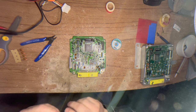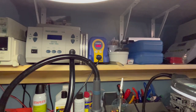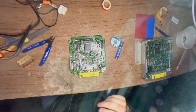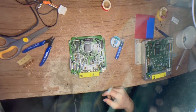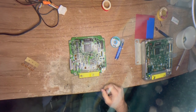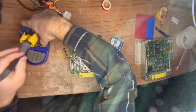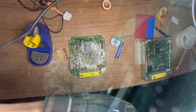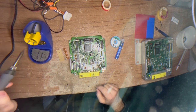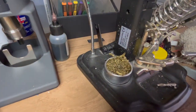You're going to need a soldering iron. Because I do a lot of this stuff, I use a Hakko FX-888D soldering station - it's a digital soldering station, very well regulated. I use it for all of my radio repair work. It is the greatest soldering iron I have ever owned. I've been soldering since I was about nine years old and this is the best one I've ever had. You're also going to want a ball of tip cleaner - that wire mesh stuff - to clean the tip of the iron.